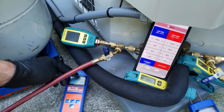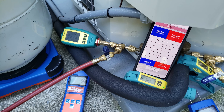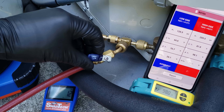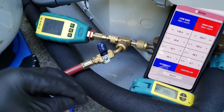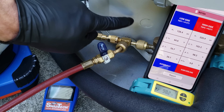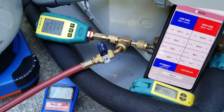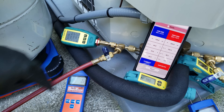We're going to recover a little bit of refrigerant. Make sure the scale is still zeroed. You can see I recovered 2.2 ounces out of this system. The reason refrigerant recovered is because the pressure inside this running system is higher than the bottle pressure — right here we have 324 PSI, much higher than what's in the bottle — so refrigerant comes out of the system and enters the bottle. On the opposite side, when we add refrigerant back in, the bottle pressure over here will be higher than the low side pressure.